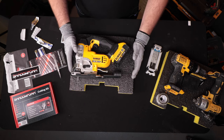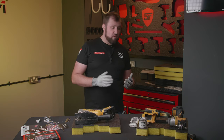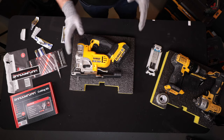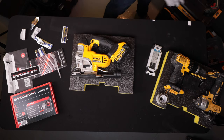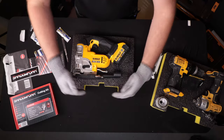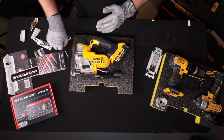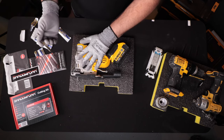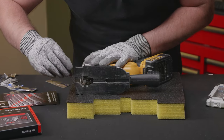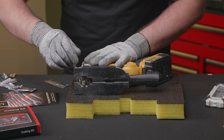We're going to start with this jigsaw — it's obviously quite a complicated item but it does sit nice and flat on the drawer. These drawers are actually full extension drawers so the drawer pulls out all the way with no lip on the back, so we can put this jigsaw right in the middle and know we're going to be able to get it out. Make sure you've got your item where you want it — squaring up that bottom edge, facing forward, with a nice even gap around it. Then we just use the scalpel to trace cut around the item, keeping nice and tight.